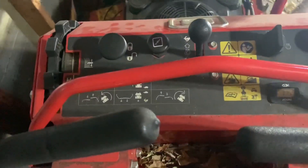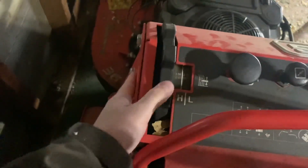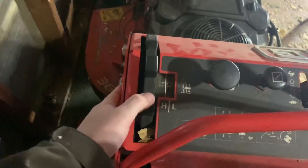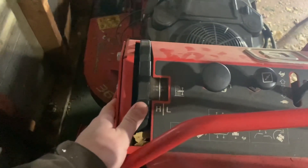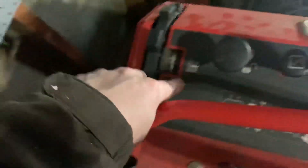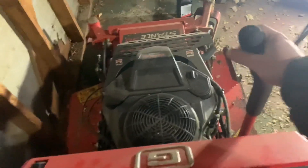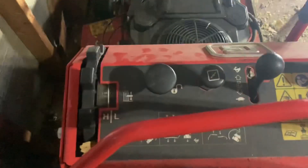As we stand on the machine, another kind of patented thing by Gravely is this deck height adjustment with the spinning wheel. You have to have your deck locked, which is in the all-the-way-up position. You can also retract it with this handle — pull it up. You've got to have the deck in the locked position.